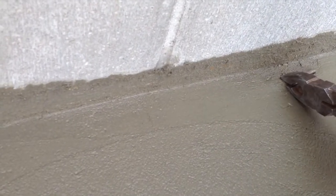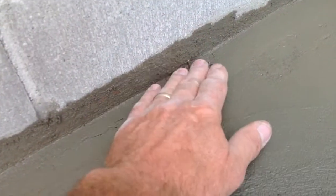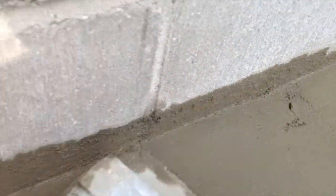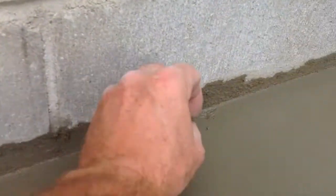I'm going over it with a float right now and I see that I've got a piece of wire mesh sticking up. I'm going to see if I can get that down or bend it or something. I think I got it — I'm going to stick a little bit of concrete in there and see if I can mush it back down. That looks like I got it down.